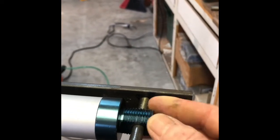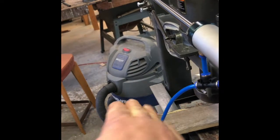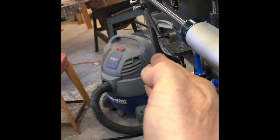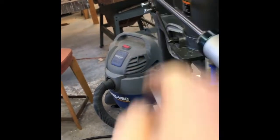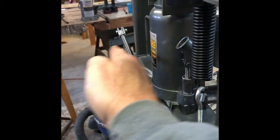This is a three-eighths bolt and it needs to be able to slide around sideways. The reason is that the valve is cocked up at a 20-degree angle, so the plane of rotation goes this way. As the arm moves back and forth it moves into a different plane, so you'll need some play back here.